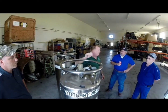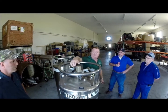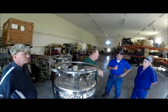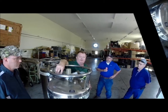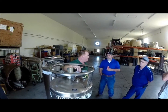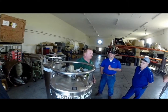Because if you don't have enough pressure and you're doing a freeze and you can't seem to get it cold enough, and you have no way of increasing your pressure, then you're kind of in trouble. So you want to be able to control your pressure. If we're doing a freeze and we have too much pressure going in to where you're shooting liquid out the exhaust, we would shut this pressure builder and that pressure will drop. Usually when we're freezing, we will have this pressure builder valve cracked open — we want to keep this venting because then we know we're right up at that pressure we want to be at. If this isn't venting at all, odds are we're not going to be working with enough pressure.